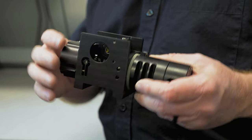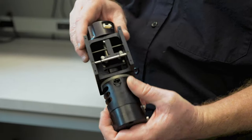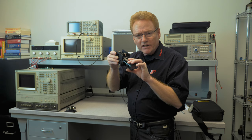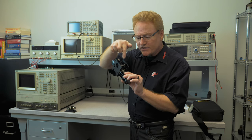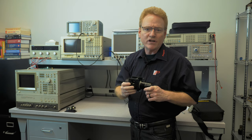This is a conventional Z-axis focuser used in 3D laser marking. You'll notice this lens and it moves along with this carrier. There are also six bearings and a special coupling that couples it to the shaft of this motor. Now because of the mass and because of the coupling, this is restricted to only around 100 focus changes per second.